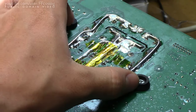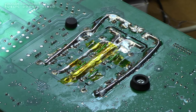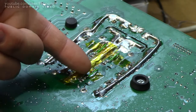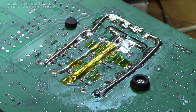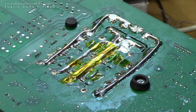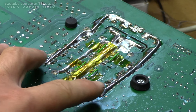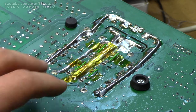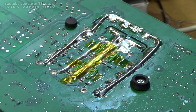I'm quite confident this thing is going to keep up without getting hot, smelly, or risking melting the plastic top cover anymore. I also added these little rubber mounts just to prevent the case from pressing down on this area, mostly to protect these little jumper wires — which, if you didn't see the original video, are in place of a couple of gate resistors I forgot to solder onto the top of the board. The gates of these four transistor pairs are just wired up in parallel, whereas the outer eight transistors have individual gate resistors. The single gate resistors are more than adequate for driving dual FETs.